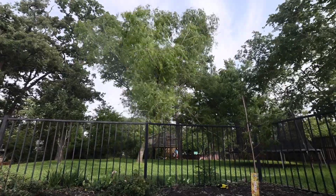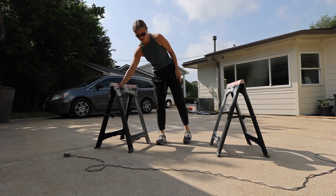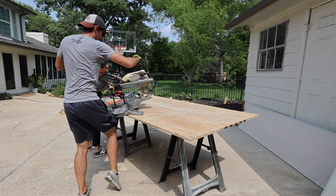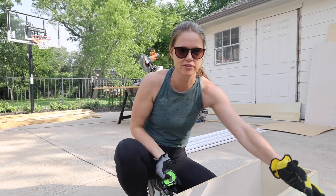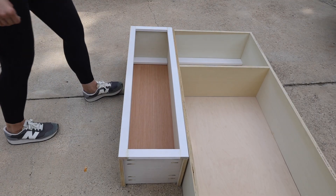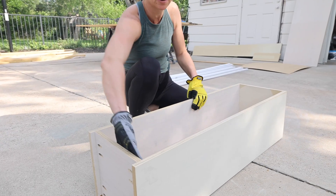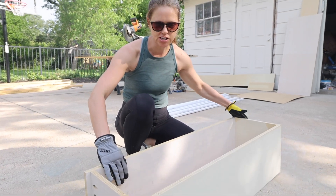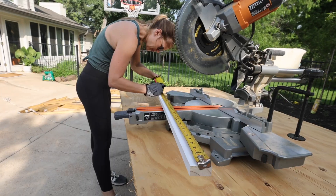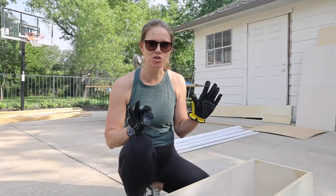It's a new week and it is so windy today. We're ready to get everything out of the garage, get the sawhorses set up, and get these cabinets finished. I'm ready to get started on the face frames — I'm going to build them flush on both the left and right sides, and at the bottom they'll be flush with the shelf. I'm using pre-primed 1x2s since we're going to be painting everything.